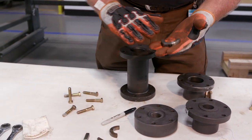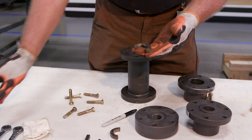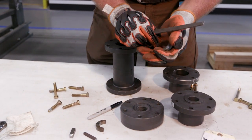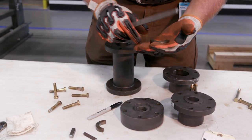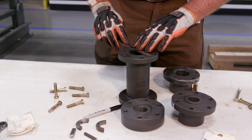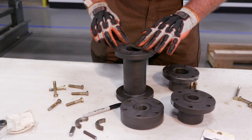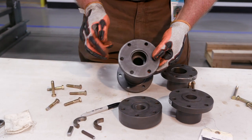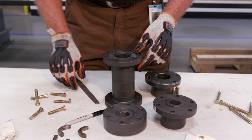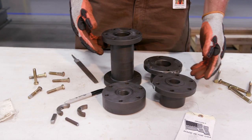Take a file and lightly touch the surfaces to make sure there are no burrs on the split rings — check both sides. On your other component parts do exactly the same thing: take the file across the face to make sure there are no burrs that are out of alignment, as any burrs will cause the coupling to run out. Once that's completed, proceed to installation on the pump after all parts have been checked.